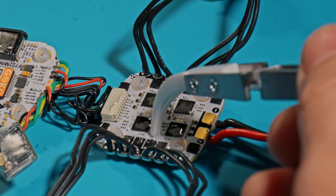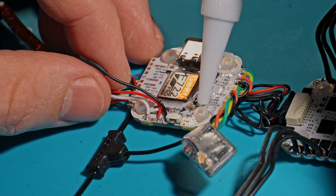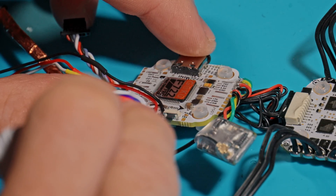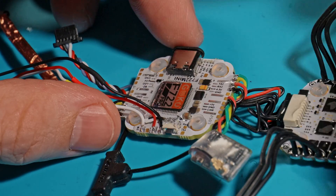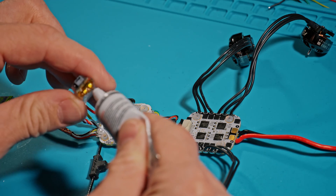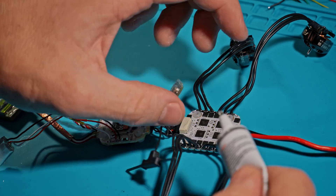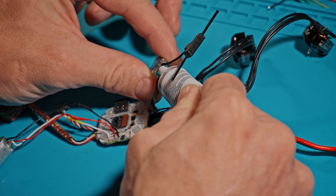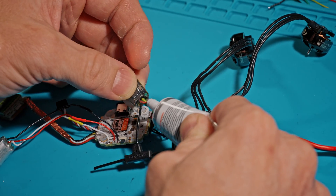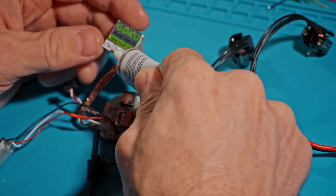This is exactly B7000 special glue for electronics — you can also use T7000, but no other. Use exactly K705 sealant, which is also specifically designed for electronics. All of the above do not conduct electricity and have good adhesion to our components. B7000 and T7000 are also very easy to remove by twisting with tweezers, which is a significant advantage over other materials. You can also use special compounds for FPV conformal coating, but they will be several times more expensive.